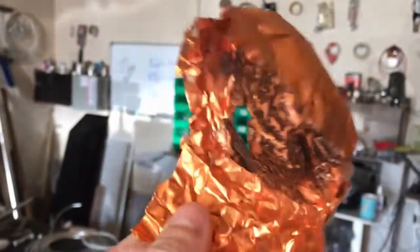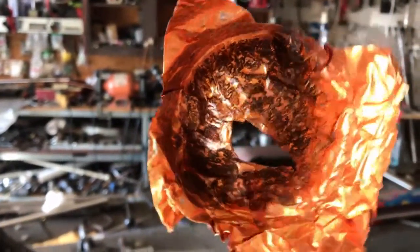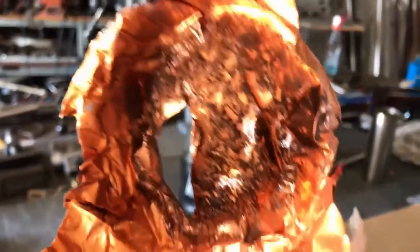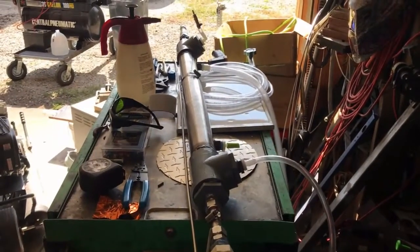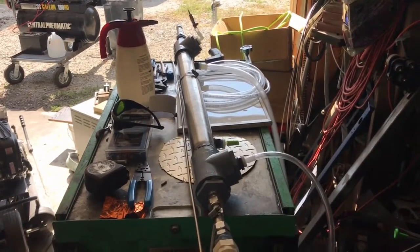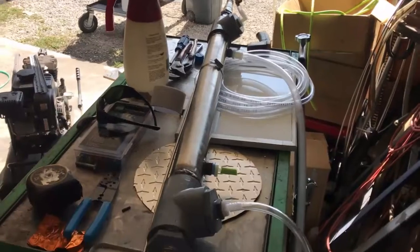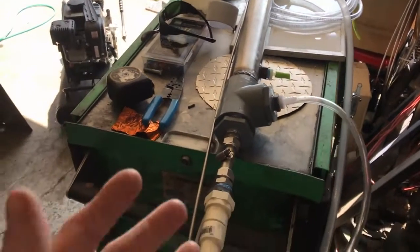It's the next day and I forgot to check our copper sample — I had copper sitting on top to observe the effects. The effects on this copper are far more prominent than the last test; we didn't get any black discoloration like this last time. So the ozone content of this unit is far more concentrated. Our next step is to fire it up at 6 amps and see how long it can withstand that. I have to climb the ladder until I start breaking quartz tubes again. Last time failure was at 7 amps without cooling — I'm almost positive we can run this thing at 7 amps with cooling, which is a tremendous amount of power. We have to gradually step into it so I can tell you the rating of these cells.